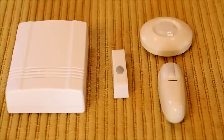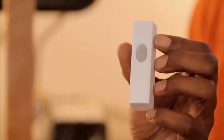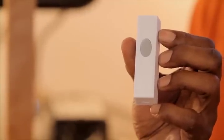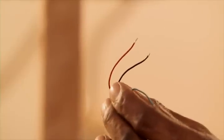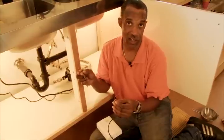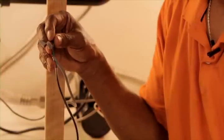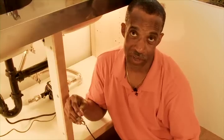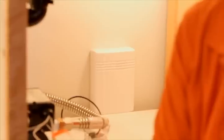The ACT Demand System also comes with a receiver as well as a wireless remote, which works up to 80 feet from the receiver. On the receiver itself, we have three wires: green, black, and red. We're going to attach the corresponding colors to the pump itself using the supplied wire nuts. With all necessary connections made, we can place the receiver on the back of the cabinet and secure it with a small screw or Velcro.